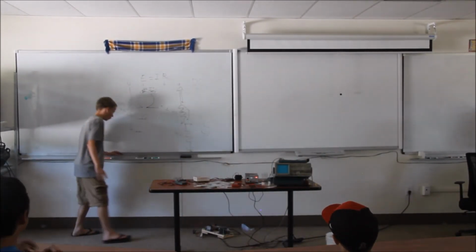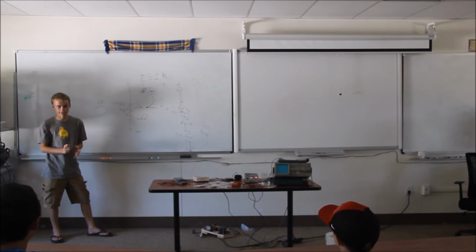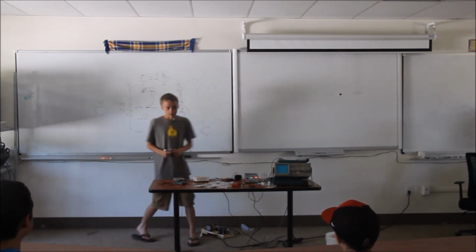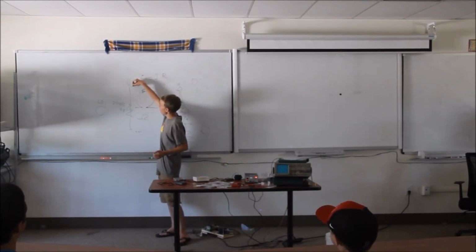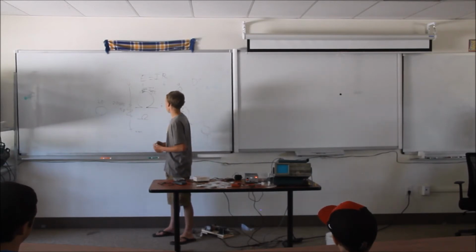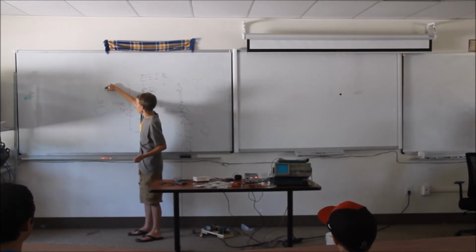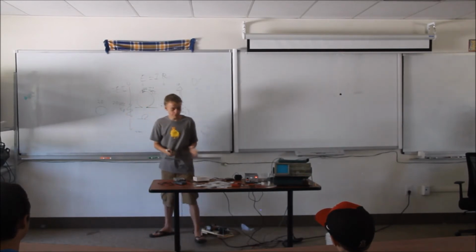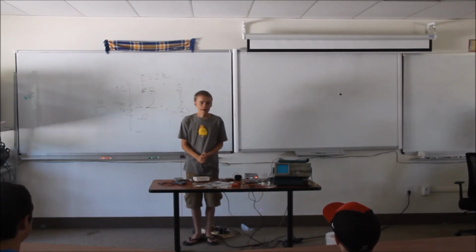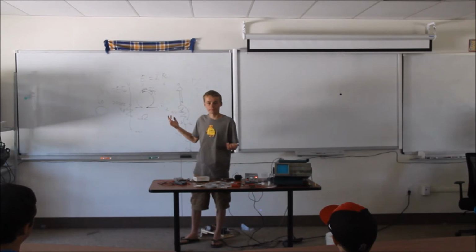Okay, so next we're going to talk about wattage. Now, wattage is, like I was talking to you about the heat being lost. So if we look up here and we see a resistor, and it's 50 ohms. Now, if there's 10 volts and there's 50 ohms, we figured out there was going to be 0.2 amps, right? Now, the formula for wattage is wattage equals voltage times current, or E times I. Now, wattage is kind of like when you see a 60-watt light bulb, a 30-watt light bulb, and that's how much power it takes. Now, power is the voltage multiplied by current.